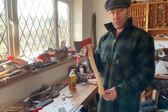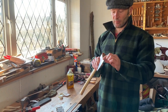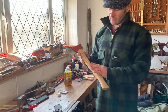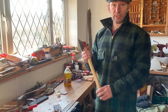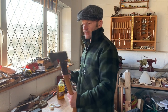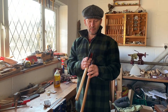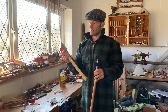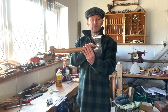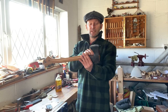There we have it — the finished article. I've put some linseed oil on the handle, put an edge on the blade, and smoothed off the edges a little bit with sandpaper because they were very rough. It's a nice straight blade — a Rhineland pattern I believe — a nice flare, and it's finished up quite nicely. No more paint, just a linseed finish. It's going to be quite comfortable to carve with. Comparing it to the Gransfors Bruks small forest axe — interestingly the head weights are very similar, but the bit length is quite a lot bigger on this one, making it more similar to my carving axe.